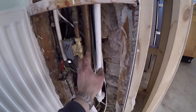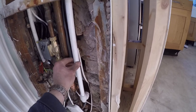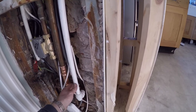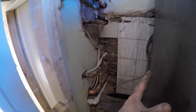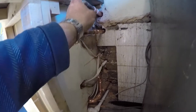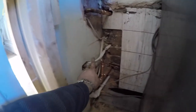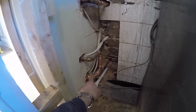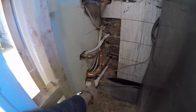The flow and return go up to the cylinder, and this is the new mains water supply — 22mm — that comes up into the airing cupboard. All this pipework goes through the wall here where the original boiler used to be years ago, so the holes were already there. We've come through with an elbow and all of those have gone through to the new boiler room.